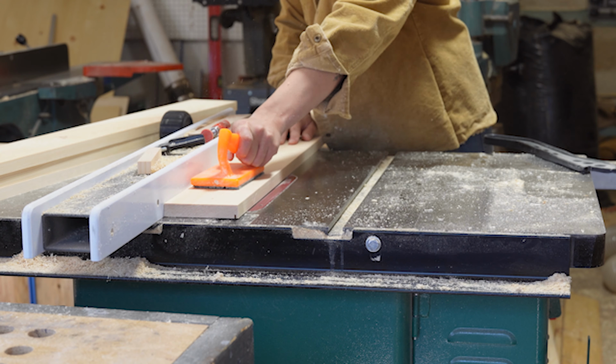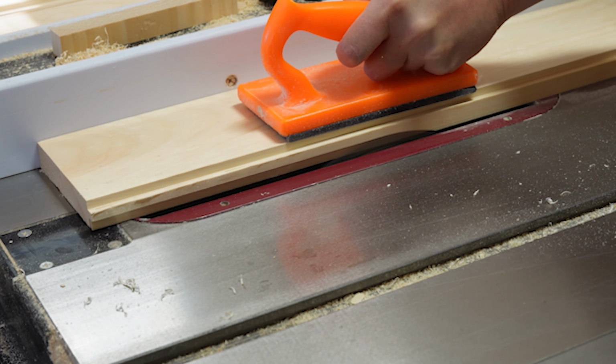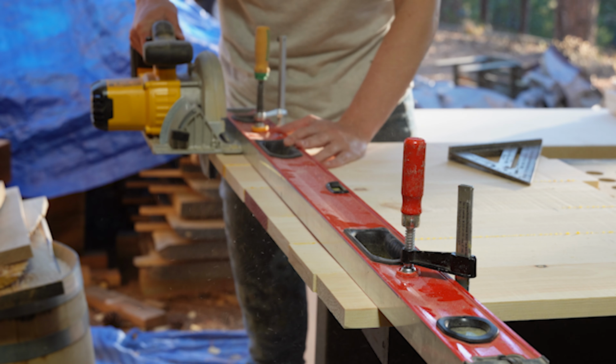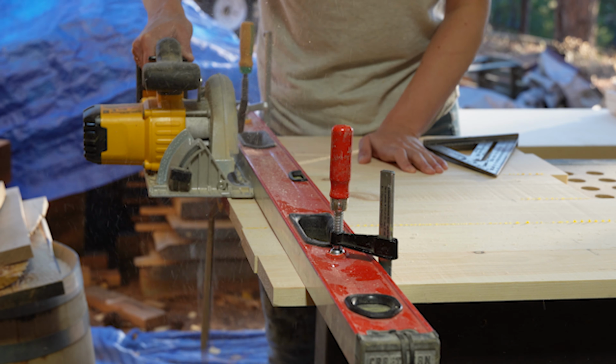While those cured, got to work on the side supports for the arches using the table saw to cut a tongue to fit the rabbet groove in the shelf boxes. I probably should have used a second push stick for this, even though the saw blade was set a half inch below the surface of the cut piece. With those ready, I turned back to the cured arch panels and used a circular saw and table saw to square off the edges of the rectangles.